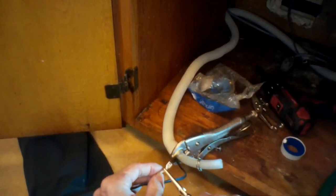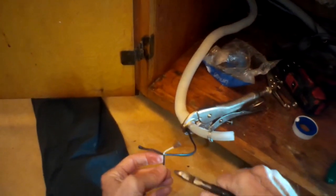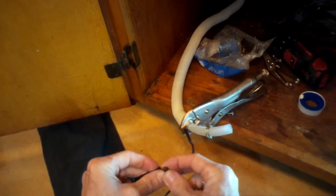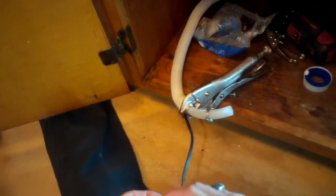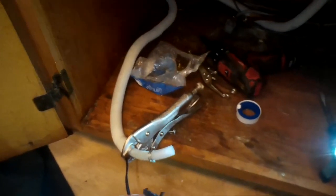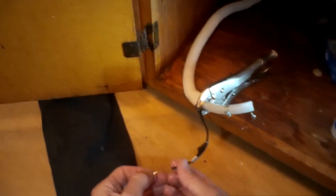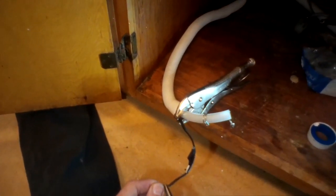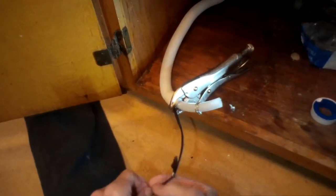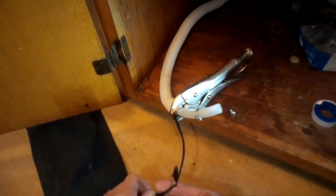This is very important: since this power wire will be exposed underneath the sink, we have to make sure we wrap it tightly with electrical tape so there's no chance it can come in contact with any metal objects. We're doing that to both sides — strip the wire about a quarter inch back, put on the spade connector, crimp it down tight with the vise grips, then wrap with electrical tape. We cut that inner tube back by about six inches because the wires have to be longer than the tube so they can reach the terminals on the fill valve.